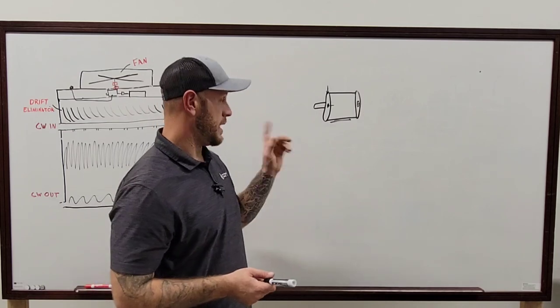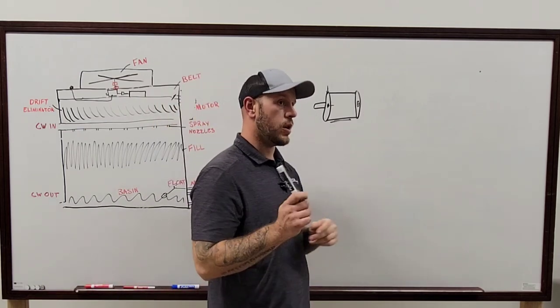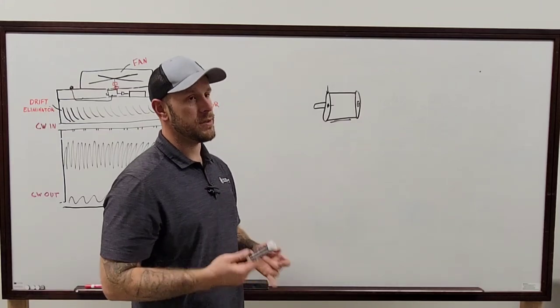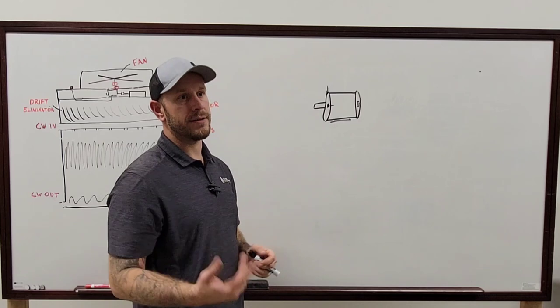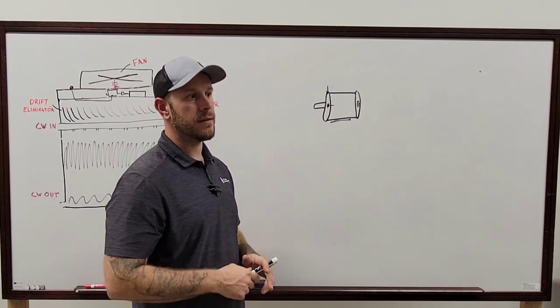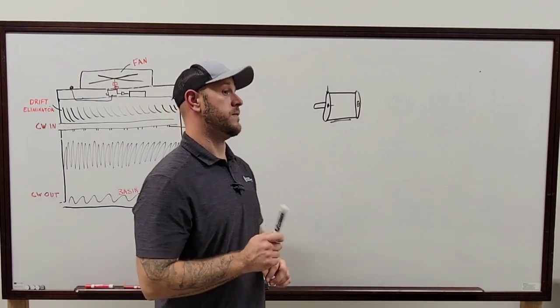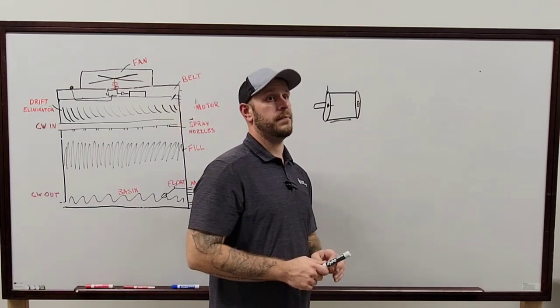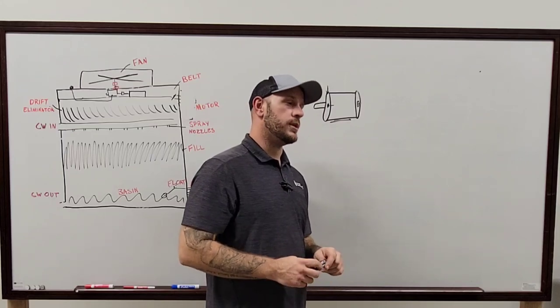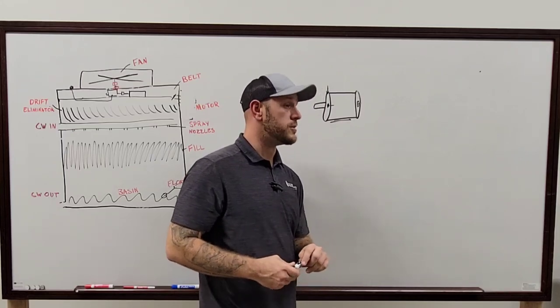And then on the bushings and your pulleys, most of the time, it's always got somewhere on there where it's got the size on there. Pulleys are usually a little bit different, though. A lot of the times they're on the backside, so that makes it kind of hard. So that's why I always look for that sticker. The bushing is usually on the front, most of the time. Very rarely have I seen it on the backside. The bushing is pretty much your important part anyway, because you want to know that shaft size.